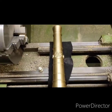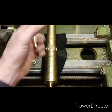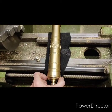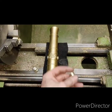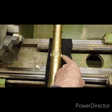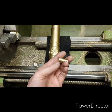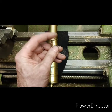Another day passes — on to the trunnions. Two trunnions, normally cast in one piece when they're made, but I started off with a 50mm bar. I would have had to start with about an 80mm section and an awful lot of machining. So as I noted earlier, I machined these in and I milled them out 7mm deep.